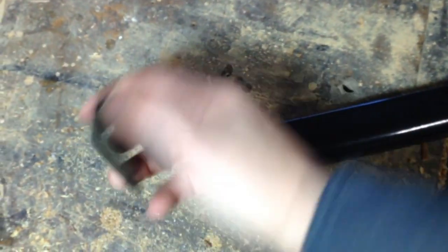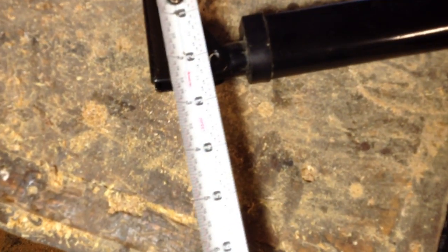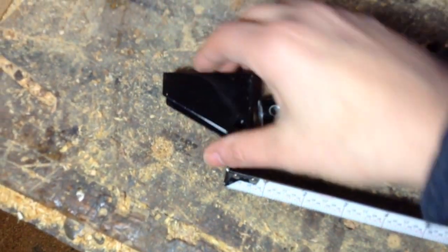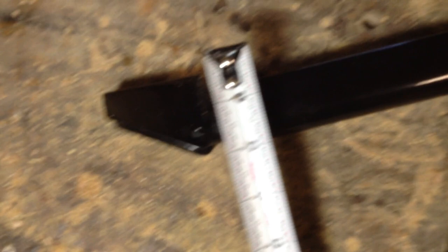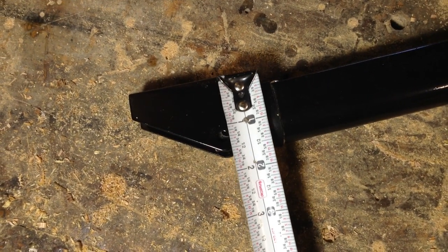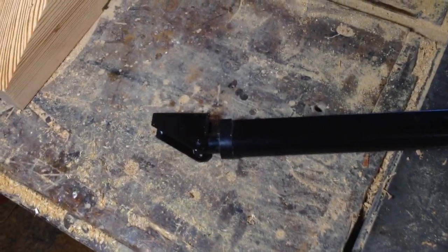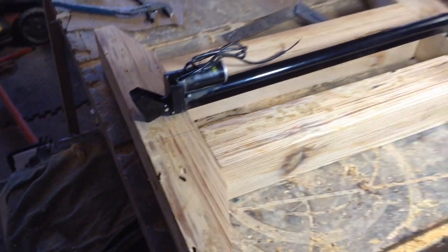The first thing I had to decide was how to mount the brackets that come with the linear actuator. These are taller because I wanted as much of the actuator still in the vertical parts of the table to make it as stable as possible. These were quite large ones — you could get shorter ones that will raise the table as much as you want and probably won't require cutting into the sides. I wanted the longest ones possible, so about half of the cradle will still be in the base of the table, which makes it extremely sturdy.